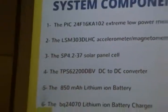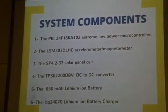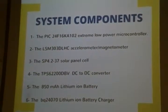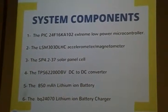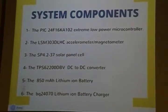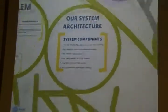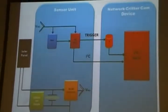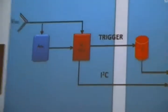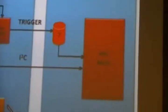Here are the technical components we use. The first two deal with signal processing: the accelerometer and the controller. The controller was chosen because it's very low power and has several sleep modes. The last four deal with the power of the system: a battery and a solar panel, a charger to interface the two, and a DC-to-DC power supply. Running the system at 2.8 volts instead of 3.3 saves a little power in the long run. Here is the block diagram showing how these components are integrated. The power supply at the bottom supplies our module on the left, and the two components doing data processing pass the signal onto the parent module when appropriate.